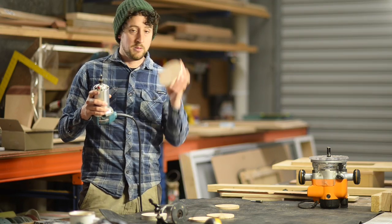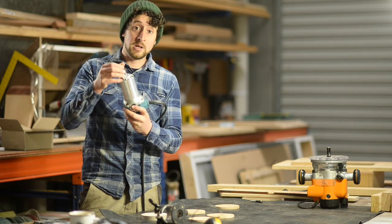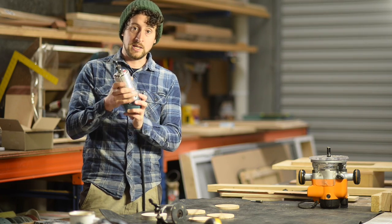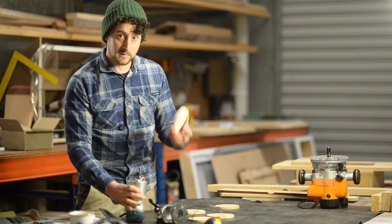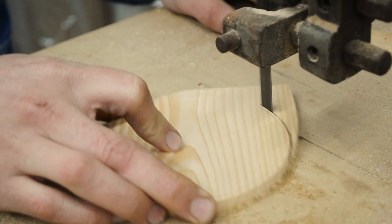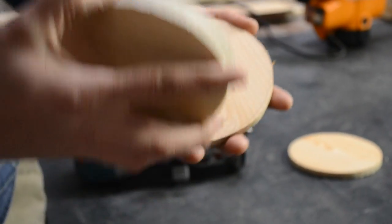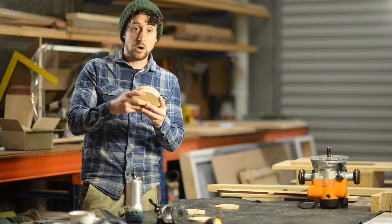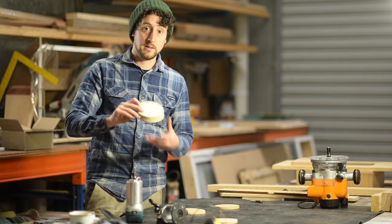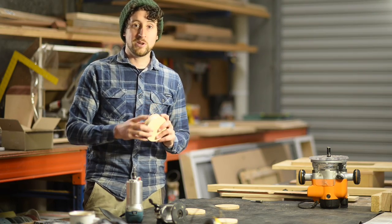The blades will be trimming my little discs so that they're perfectly smooth and round. You could also use this for trimming laminate or any other really fine work. I just like it because it's not huge and I can set it really easily - a very handy little bit. I'll be sticking my template to my rough-cut discs using double-sided tape. It holds them firmly enough for a safe routing operation. I just have this down on a piece of rubber so things won't slide around too much when I'm routing.